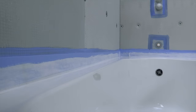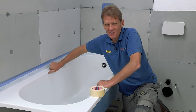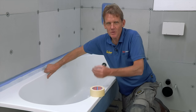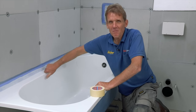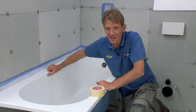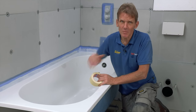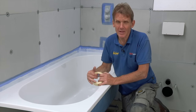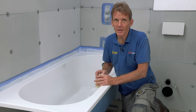At this point it's really important to protect the bath, because a tile dropped into it can cause all kinds of damage — we all know that. What I do is tape along the edge with masking tape, put a sheet of Pro-Tec on there, tape that down, and leave it there until everything else has been done.